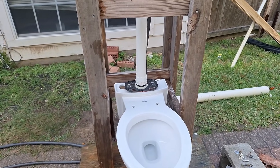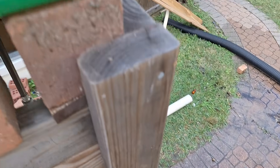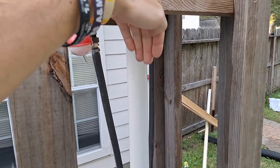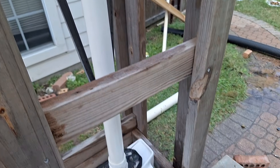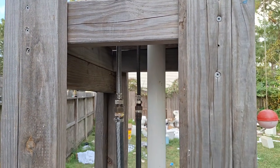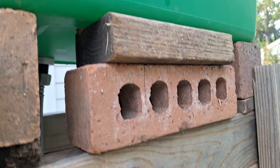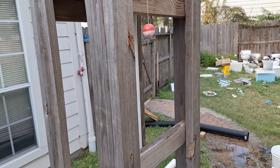One thing I forgot to mention: you do not want to cover the tube on the flush valve. This tube right here has to be open. When you have water flowing through the pipe and you cut it off, there's still water in the pipe — normally it drains down through the toilet, but if you block the pipe there's nowhere for air to enter and the water stays in there. When you try to lift the flapper it'll have all that water weight pulling down on it and you will break the chain or the flush handle. So you absolutely want an open tube at the top — put an extension on it like I did so that doesn't happen.